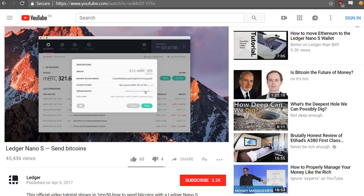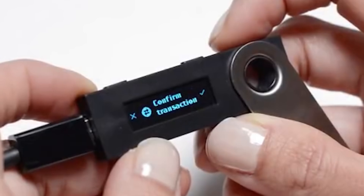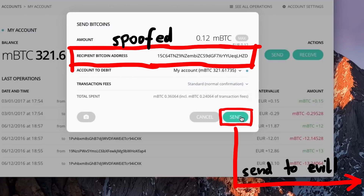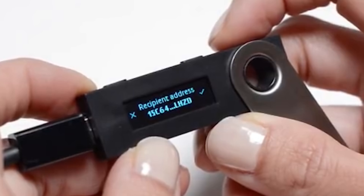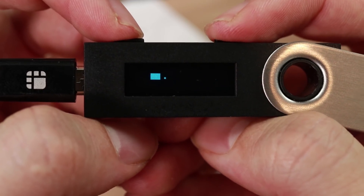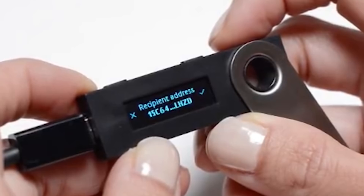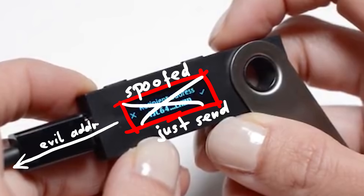What does this mean? Let's look at a generic software wallet first. If your computer had malware, it could compromise your wallet to send bitcoins to an evil address. But with a Ledger, it has to ask the Ledger to sign that transaction. So even if malware could fake what is displayed on your laptop's screen and fool you into thinking you're sending to a trusted address, with the Ledger it would show you that you are about to send bitcoins to a different address. But this display is controlled by the untrusted chip. We have just introduced an issue that would allow malware on your computer to write malicious code onto the Ledger. So theoretically, maybe you might be able to write code that fakes the address displayed on the Ledger and trick you into accepting it. And the buttons are also connected to the untrusted chip, so maybe you can just accept the transaction without the user even having to consent to it.